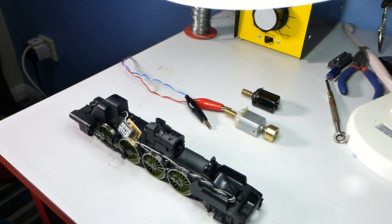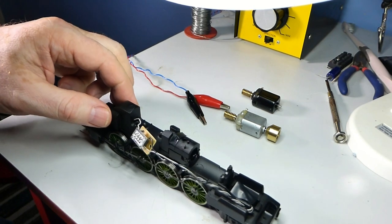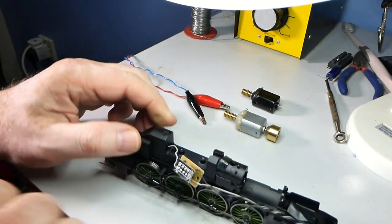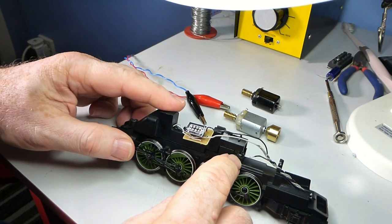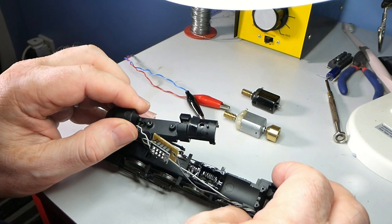Because of the bad running of the old original motor, I'm very tempted to replace it. I've taken apart the P2 — there are screws there and there which hold this weight on, and it disengages via a clever little hook and claw just here. Then you can get in to see the gear mechanism.